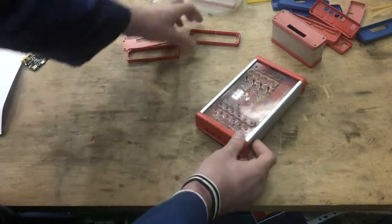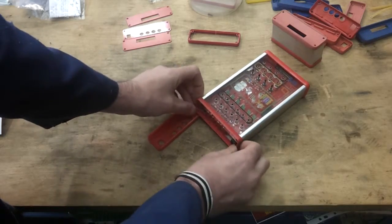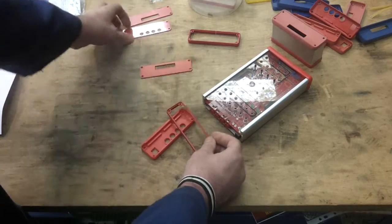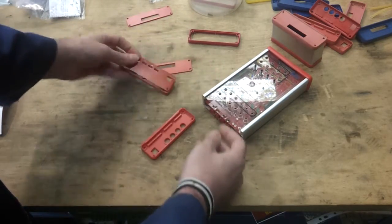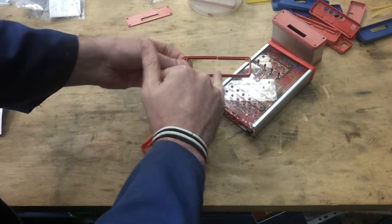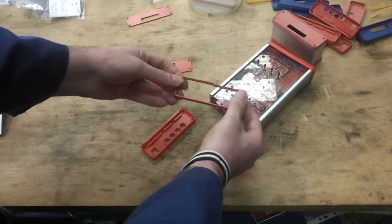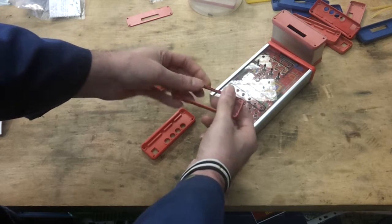Originally for the end caps he was buying in these little surrounds which come with the extrusion and laser cutting out these brackets which just fit over the front and the whole lot screws together. Unfortunately whoever made these didn't put a great deal of thought into it because they've got a feed point on one side and they're trying to flow plastic around a very thin section and get the weld line on the opposite edge, and of course this weld line is proving to be a bit brittle.